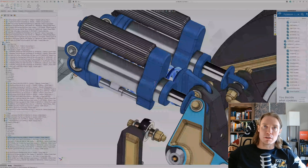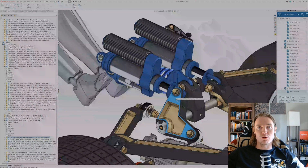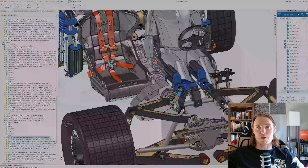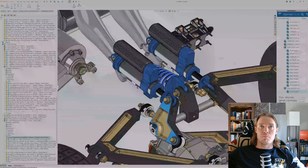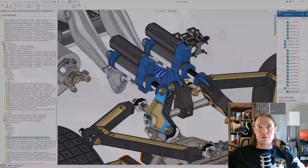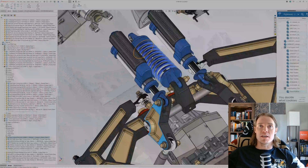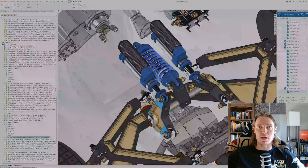It was a great pre-existing model from other off-road designs and the right length because the push rods are mounted in the middle of the arm, so for 12 inches of wheel travel the shocks only need six inches of stroke. I have these bypass shocks on both sides with another torsion bar in the middle. Because this torsion bar is really short, I don't expect it to deflect much in angle, meaning the front is going to stay really flat. These are shocks but not springs, so I needed a spring — in this configuration the center spring is called a heave spring.